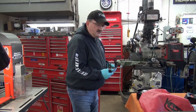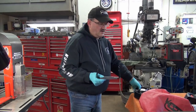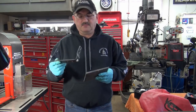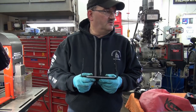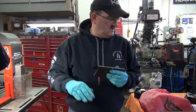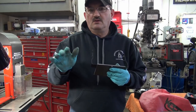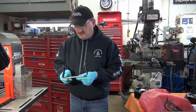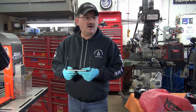Well, taking into consideration just how heavy the speaker is, I'm going to take its original mount and adapt it to some 316 plate. And by doing so, it'll allow me to raise the speaker up further past the battery and also clear of the air conditioning lines. So I'm just going to use the ironworker to stamp them out, thread them, then bolt them on.